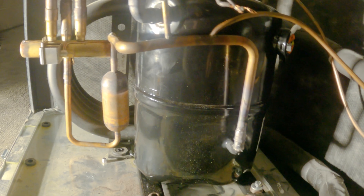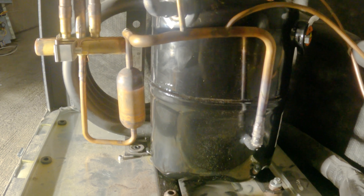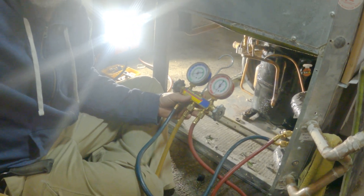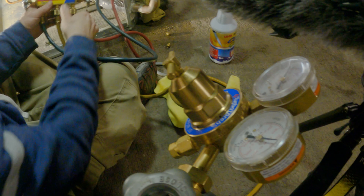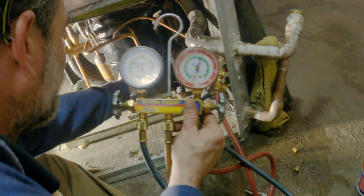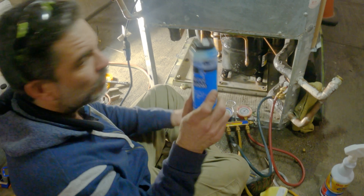Got this all soldered in. I'm going to let this cool for a little bit, take a little break, and then come back and pressure test it. We're nice and cool now — got our gauges hooked up. I'm going to open the regulator up and preset it to 200 psi and then just let the gauges go. You can put your hand near your braze fittings to check for leaks, grab your soap bubbles, and soap bubble on the spots that you brazed.